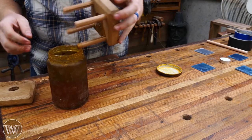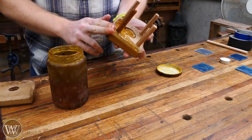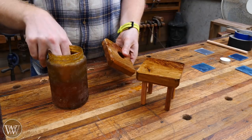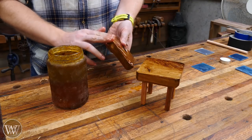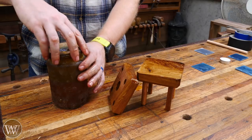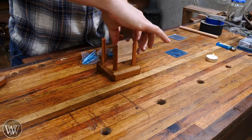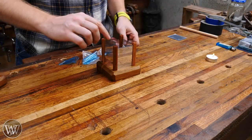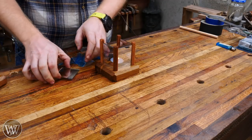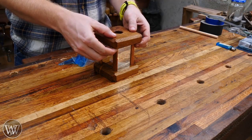And of course, because this is a Wood by Wright project, we're using boiled linseed oil and paste wax. If you don't know my method by now, I have several videos on exactly how I do boiled linseed oil and paste wax — you can find those on the main Wood by Wright channel. It's a lot of just applying the boiled linseed oil, letting it soak in. I'm not waiting for it to cure. I'm going to do three or four coats, just letting it soak in until it's not doing any more, wipe it off, and then add paste wax. Then after that is done, I can slide it all in, light the tea light, put that in place, slide the last piece of plexiglass in, put the top on, and we have ourselves an infinity mirror thingy.